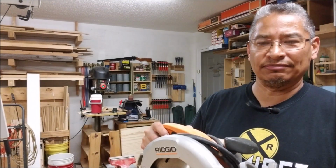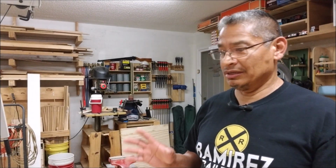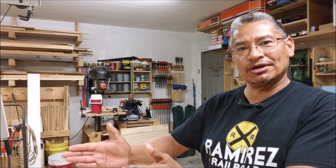All right, I'm not promoting Ridgid. Ridgid is just what I have. It's what I use. I like them because of their guarantee. They're a good saw. They're a straight saw. When I buy the saws, and again, I go through the same idea, if I take the saw out of the box, I check to make sure that it's true. And what I mean by true is the blade is actually parallel with the platform that it's mounted to. If it is not, I take it back. Don't settle for a saw because it's crooked. Don't settle for it because you think that's how they're supposed to be. That's wrong. There's something wrong with a saw if the blade is not parallel with its base.